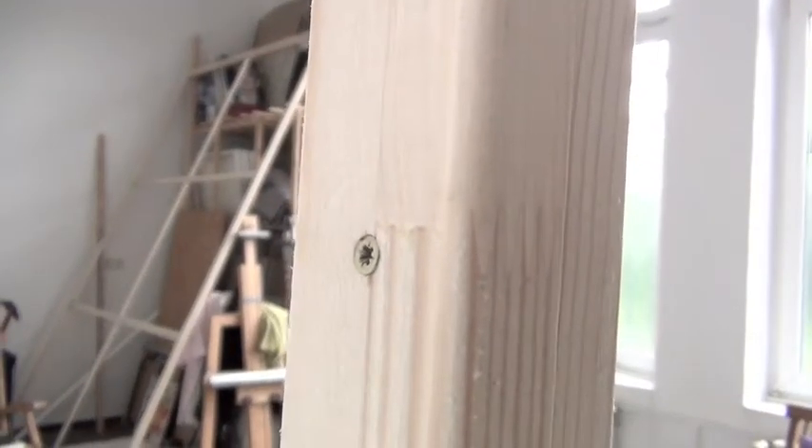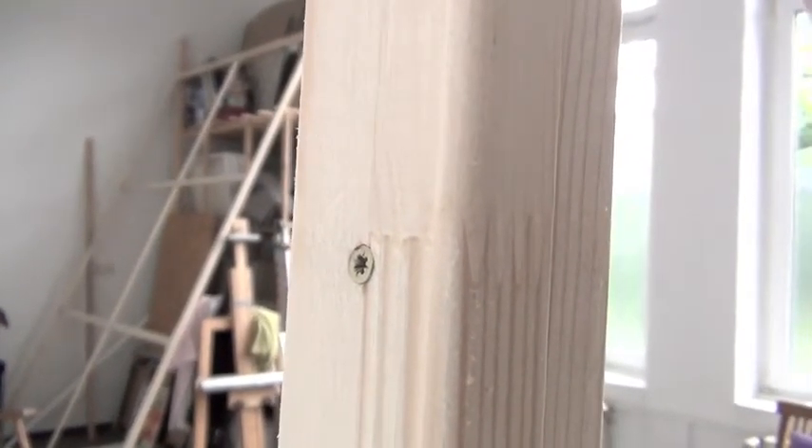For very large frames, you might need this little speciality: a double frame. It's two frames attached to each other so that the elevation is on the outside. When attaching, make sure you use screws from the back side so it doesn't come out on the front — it's very important. Nails will not do it.